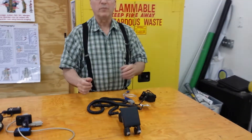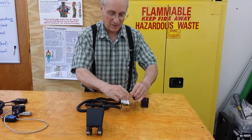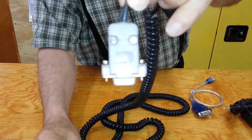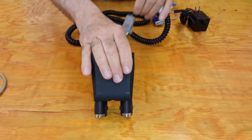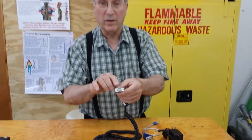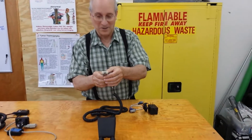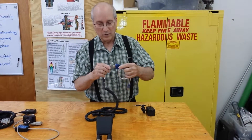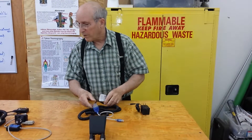Now let's move to the C4000. We still refer to it as a C3000, but the serial number — five digits — starts with a four. If you have one of these, you have a smart scanner. There's a computer in the scanner head that allows us to come out with just a two-wire connection, which I'll call a smart serial connection, which can then go directly to a USB port using just a USB-to-serial converter.